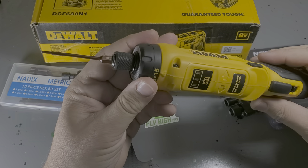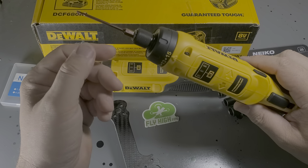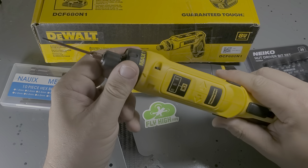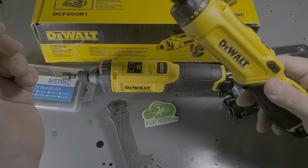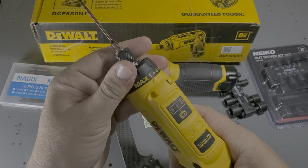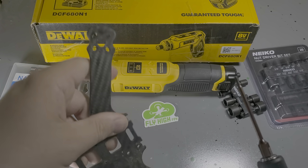It's really, really important that you get one that has the clutch. I've been leaving mine set right at 15 to do my M3 and M2 work, and then when I want to go do props or I just need something to come undone, I crank it all the way up to max — and that works fantastic. The clutch is going to allow it to actually slip instead of just stripping stuff out.